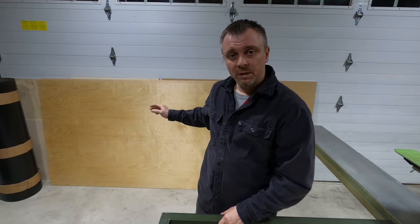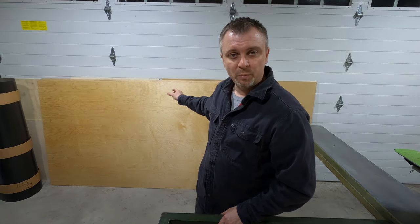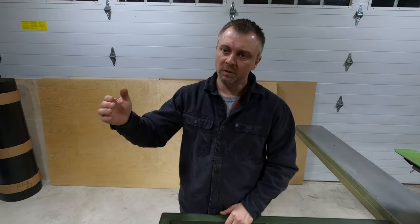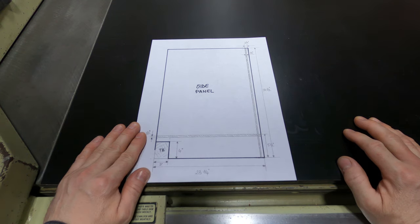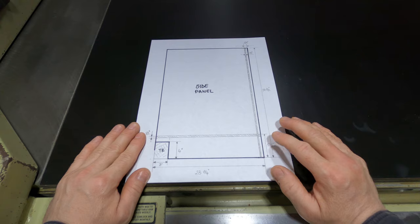The materials I'm going to be building this kitchen out of is half-inch pre-finished birch ply, and for the back panels I'm going to be using some quarter-inch pre-finished birch ply. And for the shaker doors, face frames and all that, I'm going to be using maple and quarter inch maple ply. I'm going to start the build with a 36 sink base cabinet, and I just made a sketch here